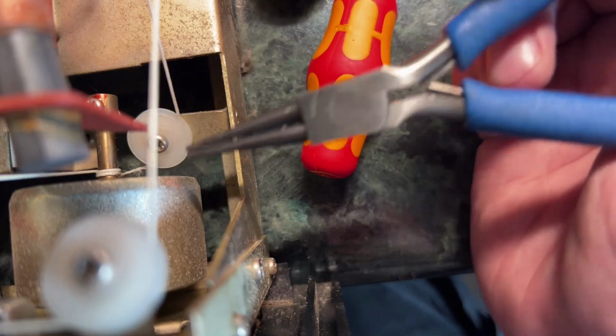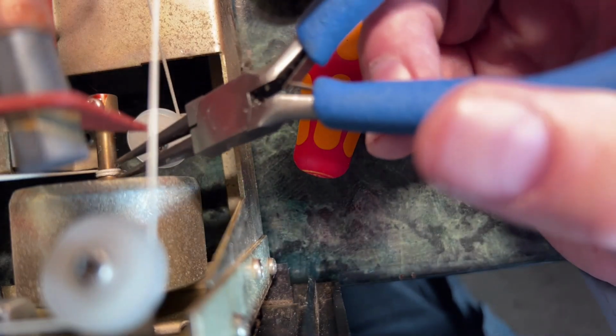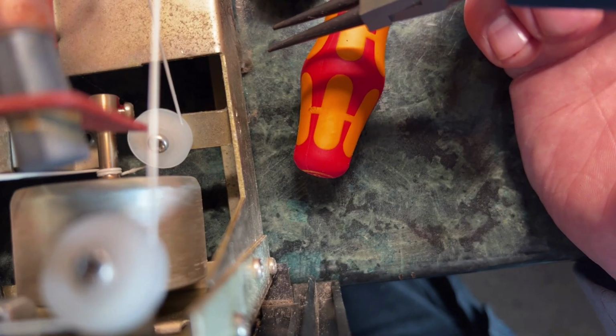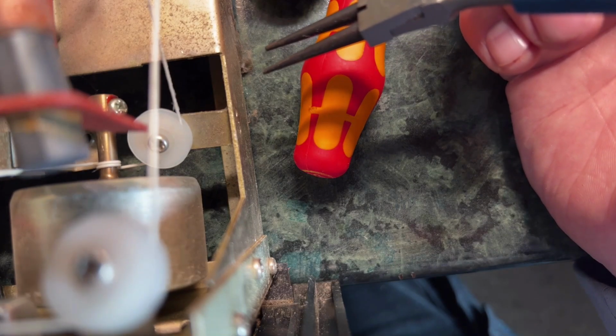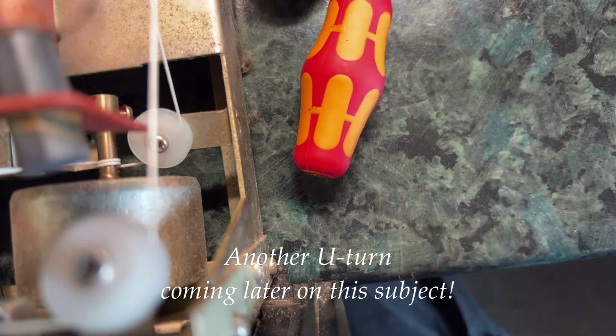But what's happened here is, I think it is a problem with the cord itself, because that frayed bit is causing us an issue. If I turn it, you see there's that little frayed bit there. So I can go all the way to the other end here. It moves up and down on the shaft, but that's not necessarily a problem. I've turned that all the way now to 87, the low frequency end. So I'm coming back up towards the high frequency end, and there's a point where that frayed bit comes back, and when that happens, you see it jumps, because it's a little bit thinner at that point of the cord. It jumps over there, and then it gets stuck in a loop and stops, because it's now crossed over, so you've got a crossed loop there.